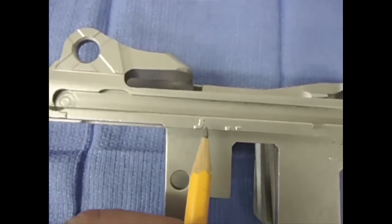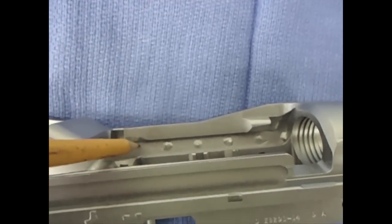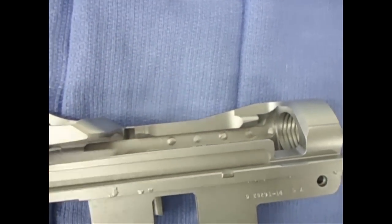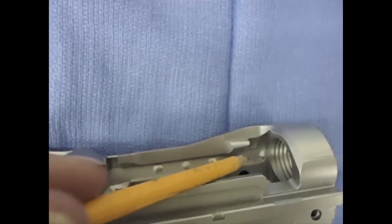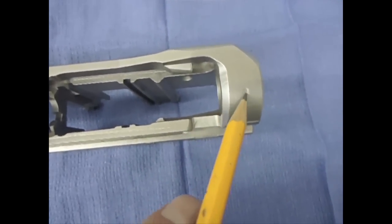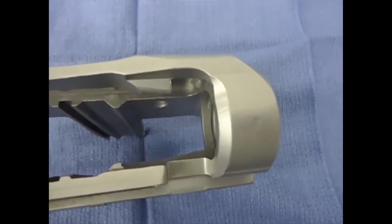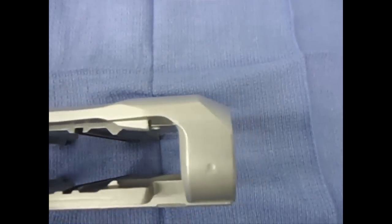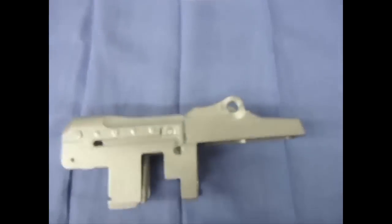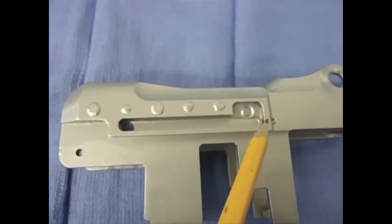A couple little minor marks - nothing of any great concern. And then the other side - these few odd spots I had built up on the other side. Once again, that's all easy. The toughest thing by far is going to be in here. I'll probably have to get a mill, put this in the Bridgeport and put an end mill and run down, and hopefully we can clean that all up. Might need a little hand work down in that corner. I'm not sure yet, but we'll figure it out. Other than that, it really needs nothing else. We're leaving that mark right there - the customer wants me to leave it - we just don't know if it's an inspector stamp or a flaw in the casting. So I'm going to go ahead and start filing.